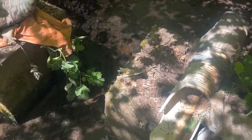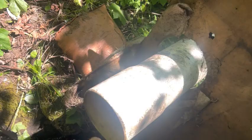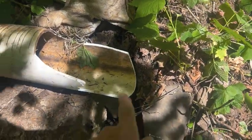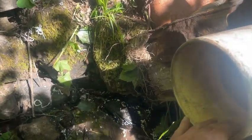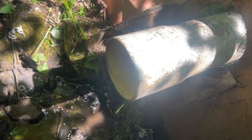Okay, here we are coming up to the creek. So this is where the pump is — I'll show you more of that later. This section has a big piece that's gone here; I've already taken it to the dump. A tree fell on this and broke it off, so that's what we're replacing. This is the female bell end of the pipe — I'm going to slide that in there and then we'll horse the water through here.